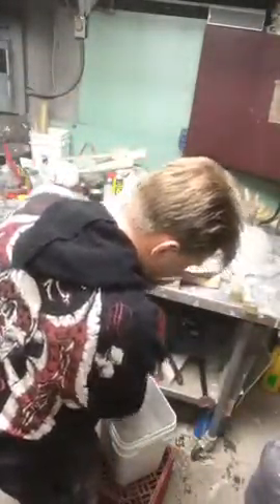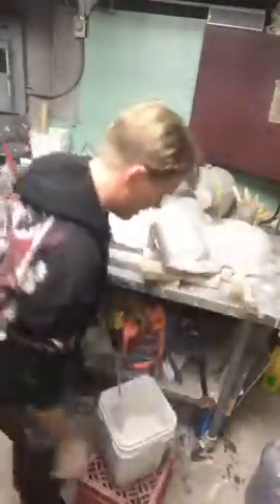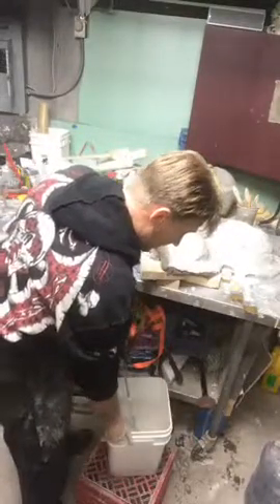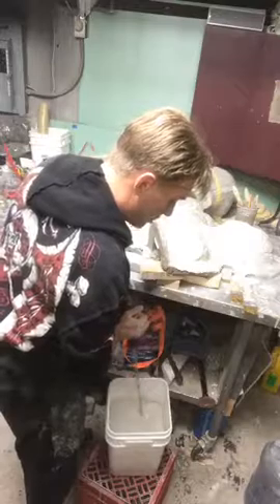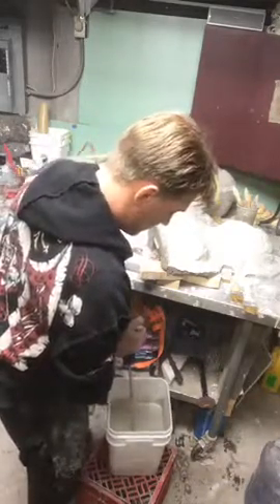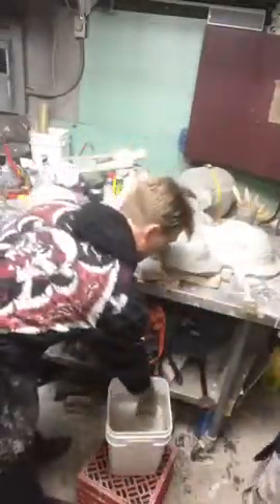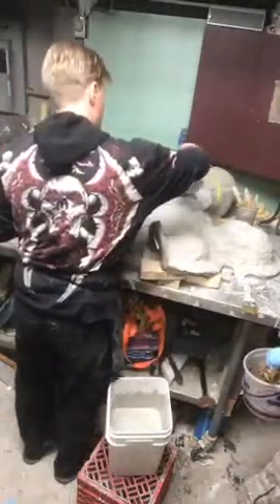The first batch of Ultra Cal was started with the consistency of a little bit of watery peanut butter. This one I want to be more like a pretty solid peanut butter — not super sticky, but with some thickness. The last batch is going to be more like Play-Doh. This one's going to kick quickly. In between we washed our brushes in water to keep them going. I'm going to keep a layer of Ultra Cal on here mostly so I have something good for the burlap to stick to.